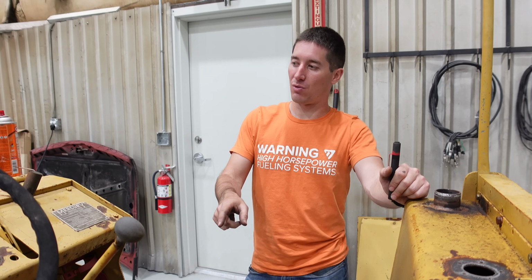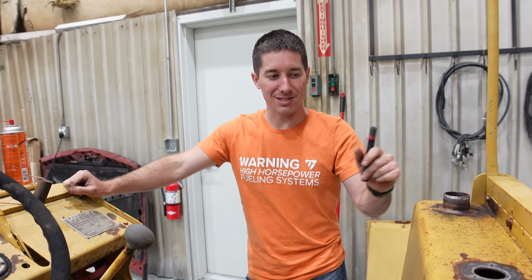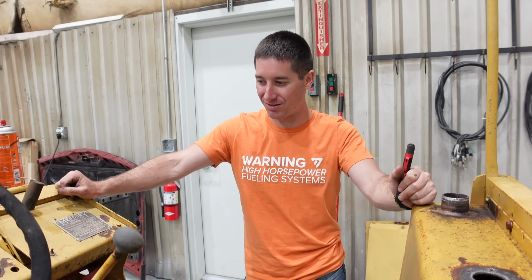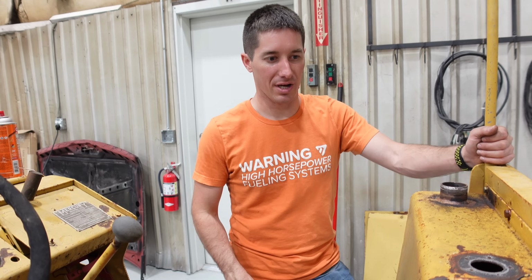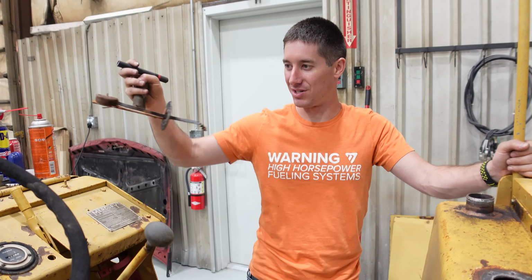We'll suck it out of there one more time with the Mighty Vac, fill it again, and then bleed the brakes, and hopefully we've got some hydraulic brakes. That'll be a huge deal. And it still needs a fuel pump and some fuel line. As far as a sender, I've got nothing. I might actually have to call Pettibone to get a sender.